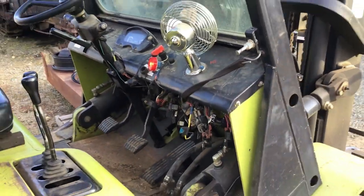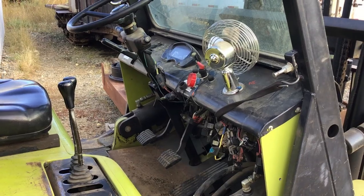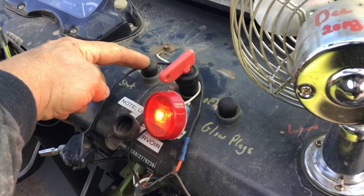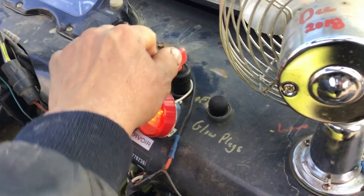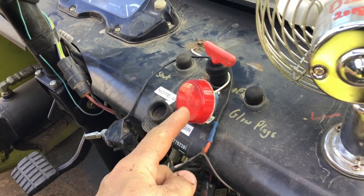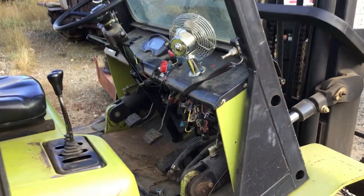So I'm colorblind and this is what I've had to do to figure out how to make this thing run. The dealership and the people of the internet were no help in getting this thing up and running. After warming up, the light comes on, you can hear the fuel pump — and notably there wasn't a voltage drop that changed the brightness of that light. After a year we thought it was a fuel problem, but it turns out it's a voltage issue. I took a dislike to this machine because I was originally buying a zoom boom.